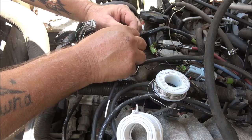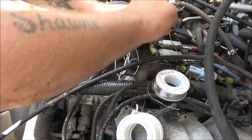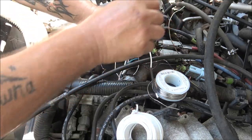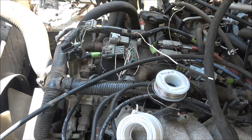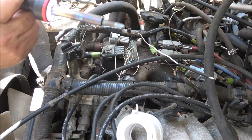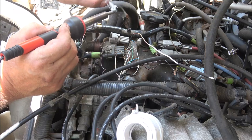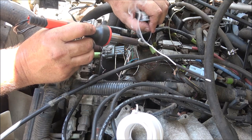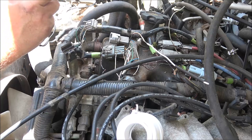There are so many different ways you can do this — I just stick them together and twist them, then solder them. They will not come off. I see guys tying knots and stuff — I don't want to do that. If you're pulling that hard on a wire you need to lengthen your wire, do something different, because once it's soldered it's not going to come off. All together I've got 31 wires to do, so I'm not going to bore you with all of that.